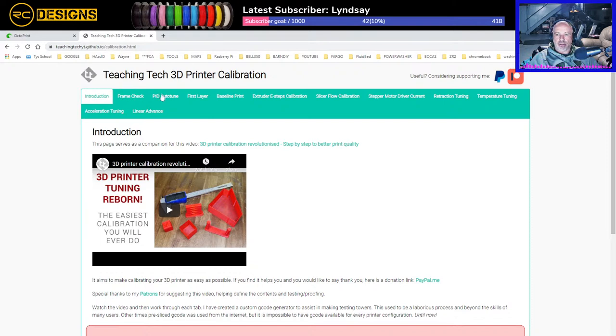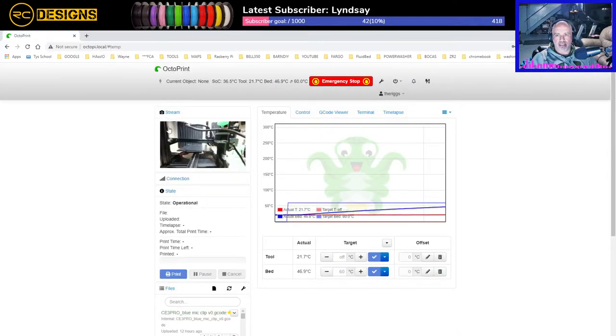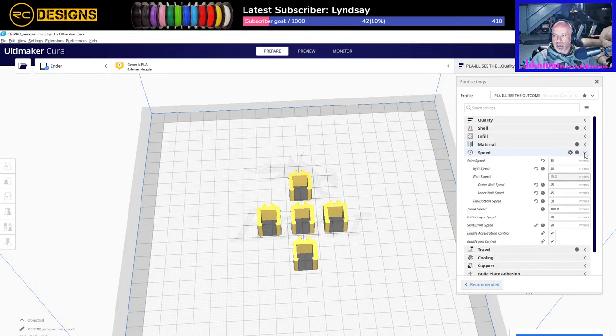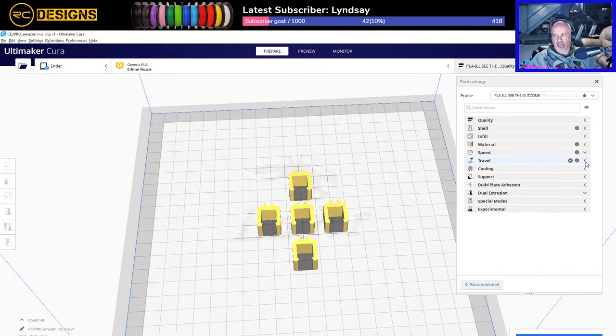You want to go to this page here. You can go through, start on the first one, go all the way across, and then extruder E-steps. He's pretty much made everything so easy to follow and to get your printer dialed in. So that's why my numbers are the way they are for the flow and the initial flow. My speeds, this is just what you prefer. Obviously your printer has limitations, but my travel retraction speed is kind of where my retraction speeds are, just to avoid any glooping or stringing between pillars or posts or anything.